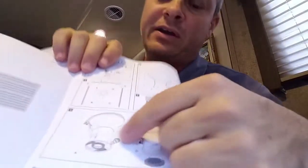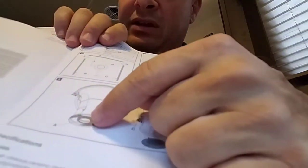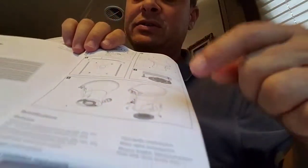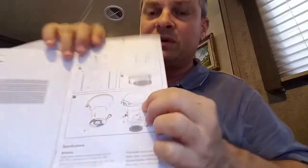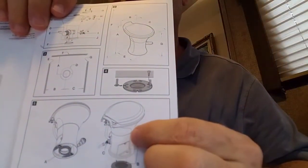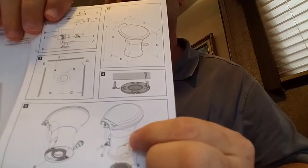I actually had a video of this but it got deleted off my wife's phone. I looked under the edge of the toilet — turned it on its side — and noticed a drip line running down the inside. Looking up into there, I could see a drip on the edge coming from high up inside. A little more investigating and it was going as high as the middle joint, kind of where the top bowl meets the base.